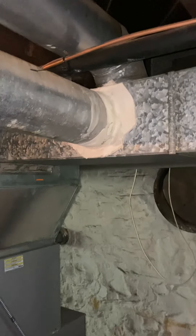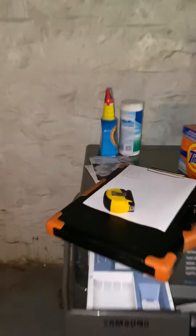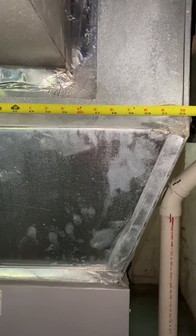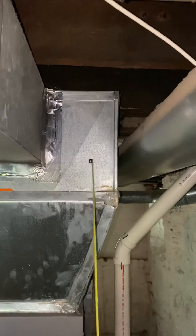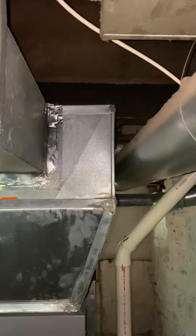It's going to be a little tight because her laundry is sitting over here just underneath. I don't want to make this much more than eight inches because it'll cut into that space. But over here there's enough room — we could get the CFM if we did a 10 by 20. There's plenty of room to get 20 inches. The return is right here, so as long as we squeeze this over to the far edge, I think we can get a 10 by 20 in here.